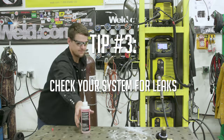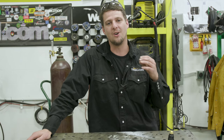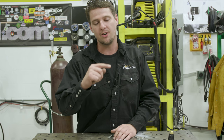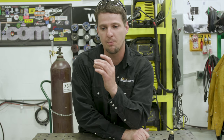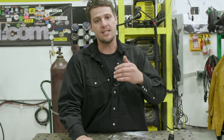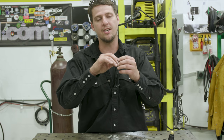If you still feel like you're wasting gas, check for leaks. That's tip number three. Check all your connections, fittings, and machine brass seats. I would start at the regulator — basically that machine brass area where you put your wrench on — make sure that's not damaged. Also check the steel part of the seat on the bottle, make sure that's not damaged. You're looking for a little nick where it's been machined nice and flush. The second thing would be the connection of the hose, that little brass connection.